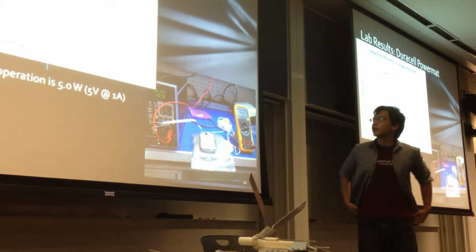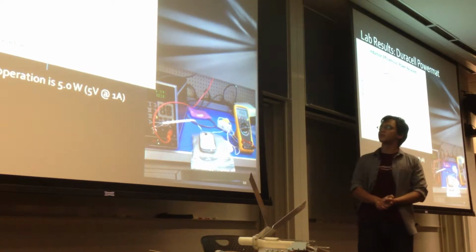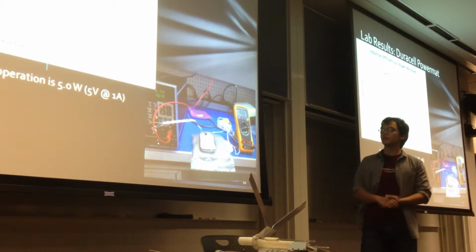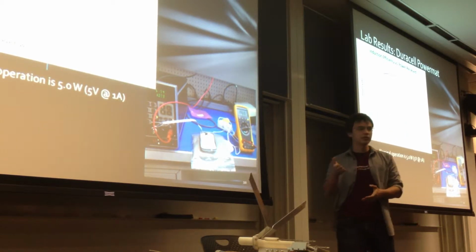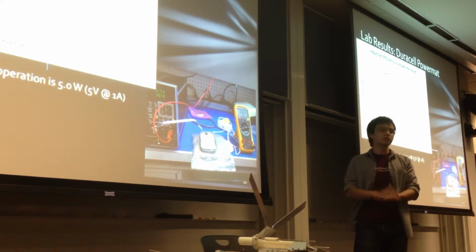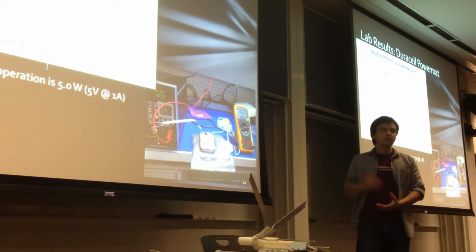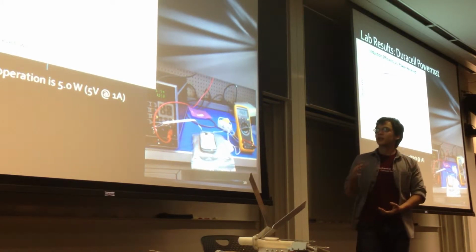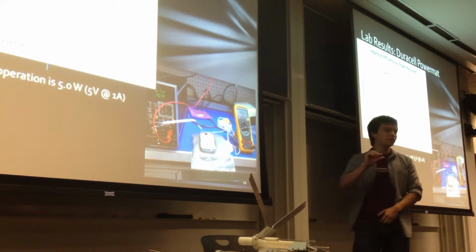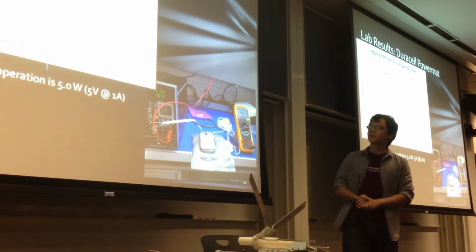So, to further characterize the interaction of various interfering materials with the induction charging pad, we looked at how the different materials affected the efficiency of the power transfer from the power source with the magnetic coils and how much power is received by the receiving end. This being a consumer electronic device, it had an ideal efficiency around 30%, and with 2.5 millimeters of the lunar simulant in between the plates, we found the efficiency dropped several percent.